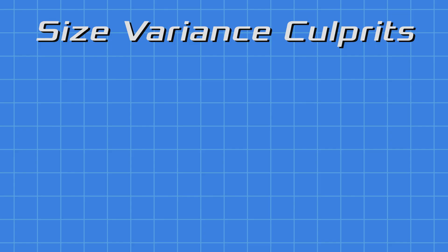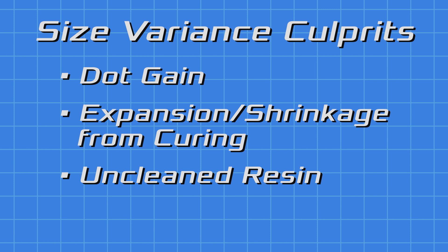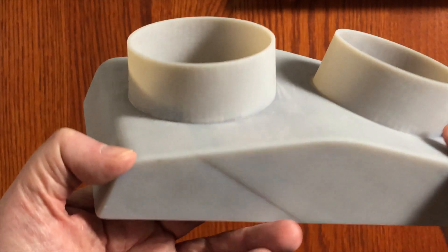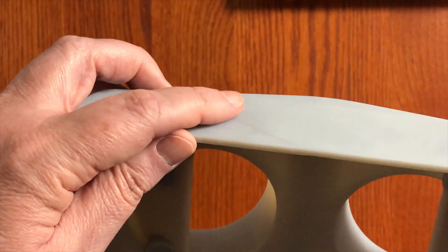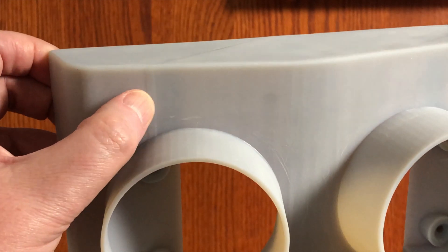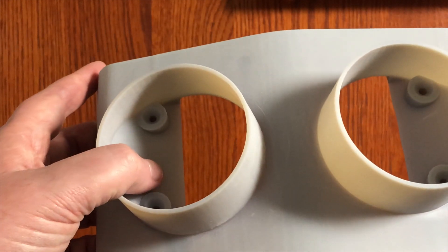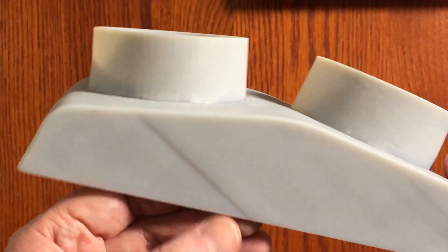That tiny variance I'm getting now could be from dot gain, or expansion or shrinkage due to the curing process. How well you clean the part before post curing could affect it, or maybe the temperature of the resin when printing. I just want to show you this part — here are some very visible layer lines but they aren't layer shifts. The part is actually smaller overall before these slices and then a little larger after this point. One of my guesses is that when you get here those slices have more area, and the larger cured area could have produced more heat and heated up the resin a little bit. Maybe my resin wasn't warm enough when I started the print. The bottom line is that there's always going to be some variance — hopefully not in the middle of a print like this one — but I want to minimize it and get reliable and repeatable results. And 0.2% is pretty good. You could continue to tweak from here, but I think this is as close as I'm going to get.